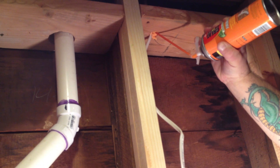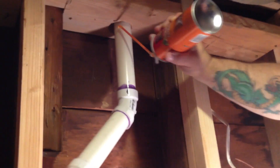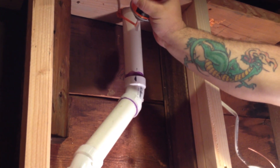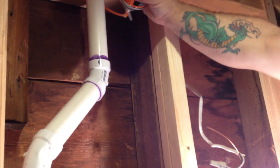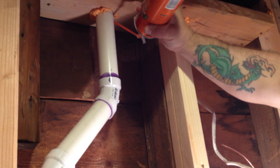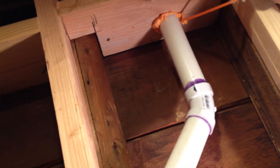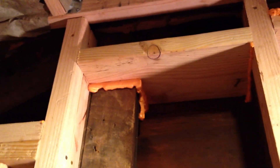We also have to do our penetrations. Anytime an electrician or a plumber runs their wires and pipes, you have the holes — as you can see — and these also need to be filled. The object of the fire cats and all this penetration foam is to close the bay that all your plumbing and/or electric is in, and when you close the bay it only has so much oxygen in that bay for the fire to burn. It's not going to allow the fire to draw oxygen from the top or the bottom, therefore it'll keep it from spreading.